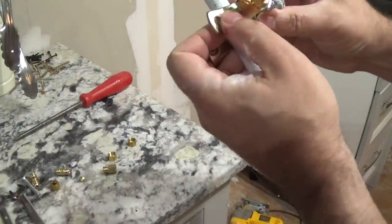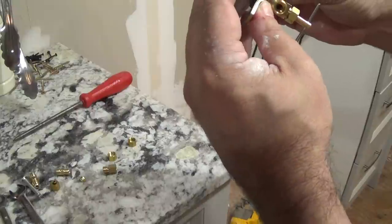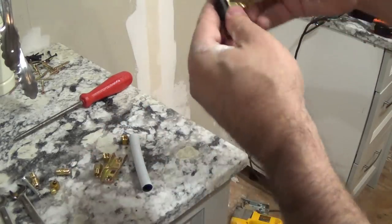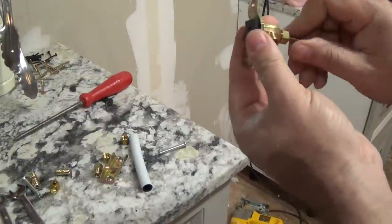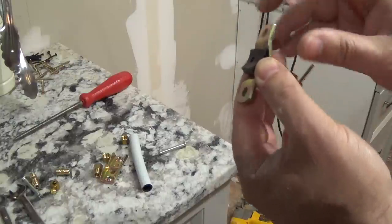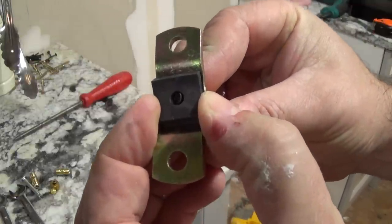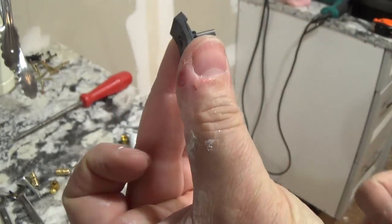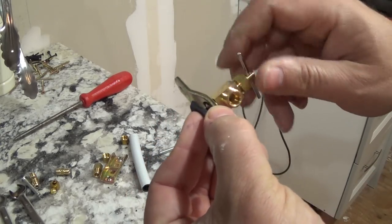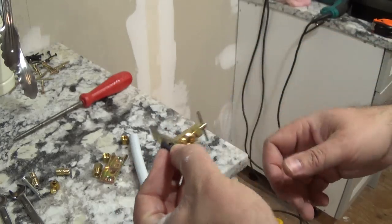You screw that in and tighten down both sides. There's a rubber washer in there — that's what gives you the seal. Once you've tightened it down to where you're tight but not squashing the pipe, you screw down the valve. The valve itself lowers a little piercing needle — you can see it just come out of the rubber washer. That sharp little needle ends up pushing into the PEX pipe and piercing it. It also closes the valve so water doesn't come shooting out, but once it's pierced all the way you just open it up and water comes through.